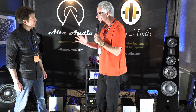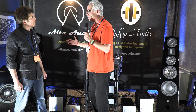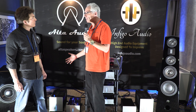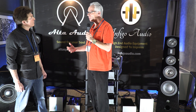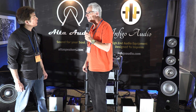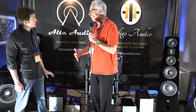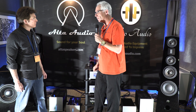What passive subwoofers do you have in mind for people to use with that? There are a couple of small, nice, little footprint subwoofers that can blend into different corners of the room or asymmetrically placed around the walls — very modern design. They could be used with flat panel speakers like full-range electrostats where the swarm fills in the rest of the bass. The device itself is not amplifying — it's an analog processor, so you can use any amplifier you may already have.